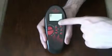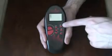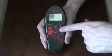The Advantage Plus modulating control includes all the Plus features and the ability to adjust the flame height and blower speeds. Both the Advantage and the Advantage Plus utilize a battery-powered receiver, while the modulating remote uses a 110-volt receiver. To begin, we must ensure that both the transmitter and receiver have power.